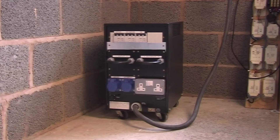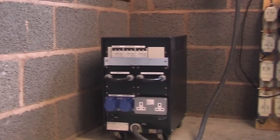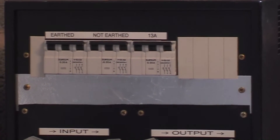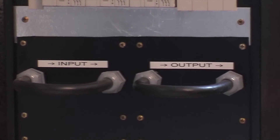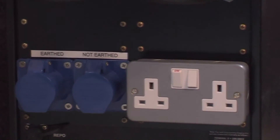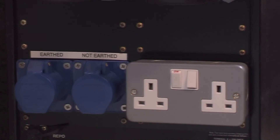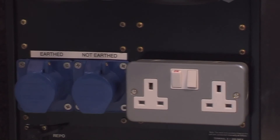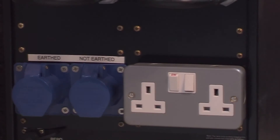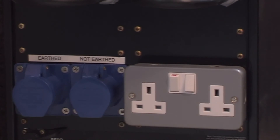Because the top was rusty I've given the lid a coat of paint, with plenty of lacquer on the top to protect it from scratches. At the top of the back you can see I've changed the back breakers to a set of triple-pole ones, basically because I didn't have any double-pole ones. And below that we have a pair of 25 square mil cable loops so I can measure the current just by hooking a clamp over. And we have a new set of output sockets — in both cases the left-hand socket has an earth connection, the right-hand one doesn't, to allow for more flexibility with what I'm doing. Let's face it, this thing's a test rig, so the more options I've got the better.